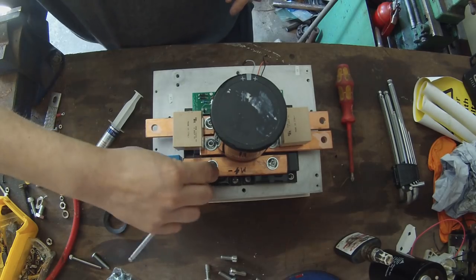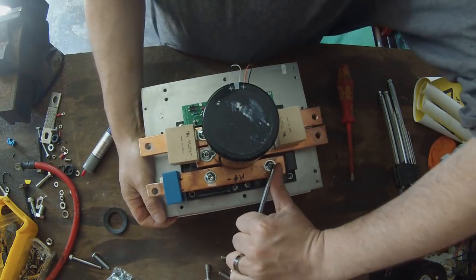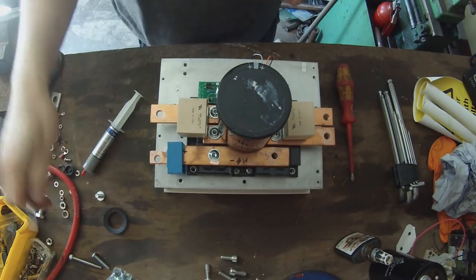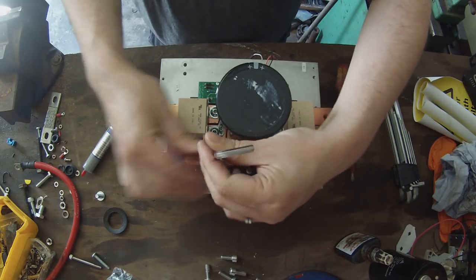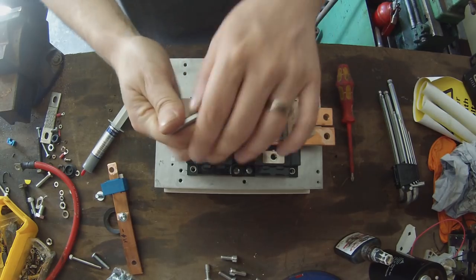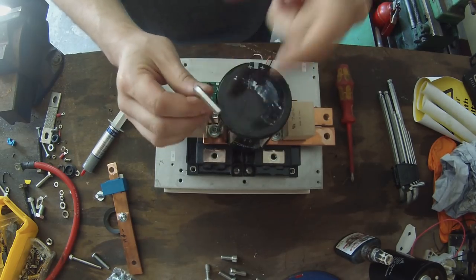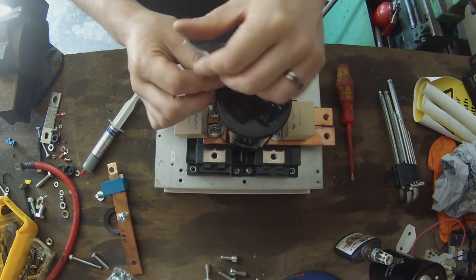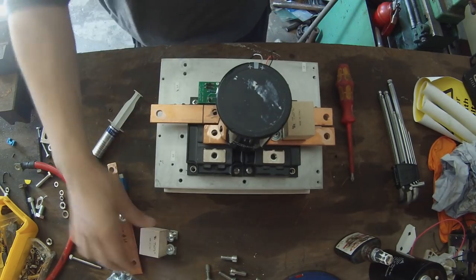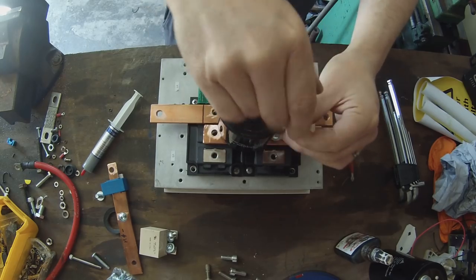So the next thing that you then need are some kind of devices to perform the power switching. And you need a stronger hand to undo these bolts because you've naturally over tightened them. Anyway, what I have traditionally used for both DC and AC motor controllers have been these IGBT bricks. These are called half bridge modules. These ones here have been rescued from the Enova inverters that I've had following me around for the better part of two years now. So these are 600 amp, 600 volt parts and are basically oldish, but they're fairly modern enough that we can use them